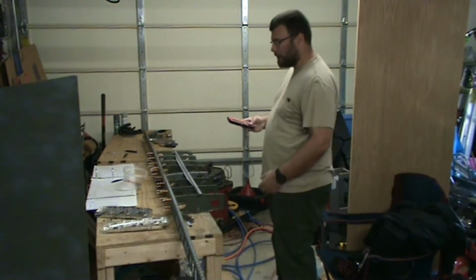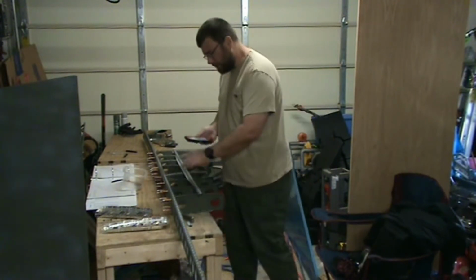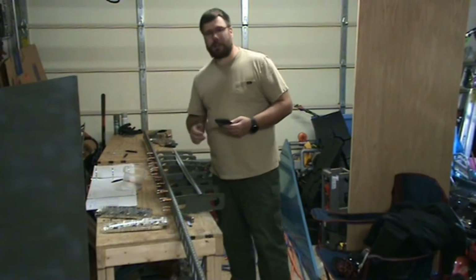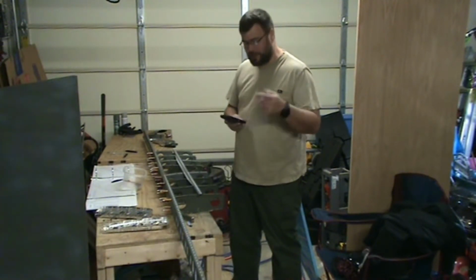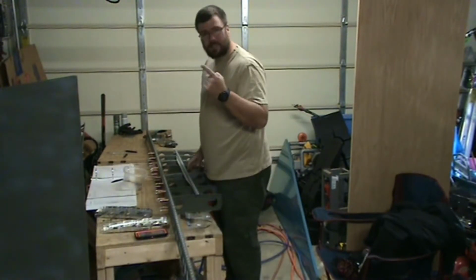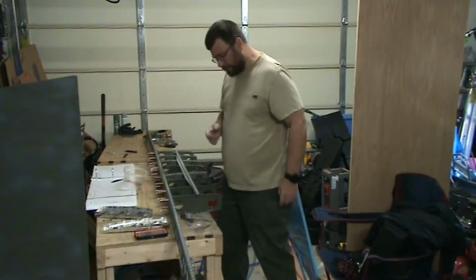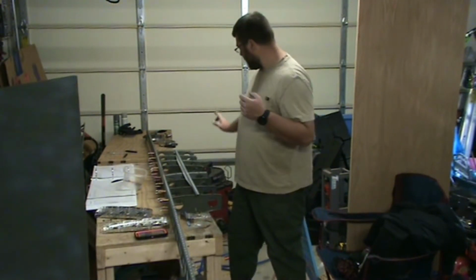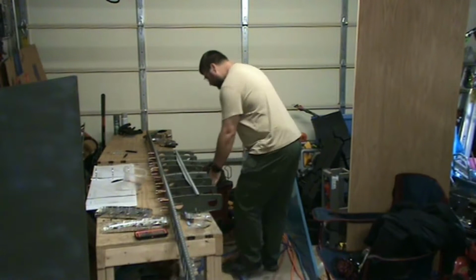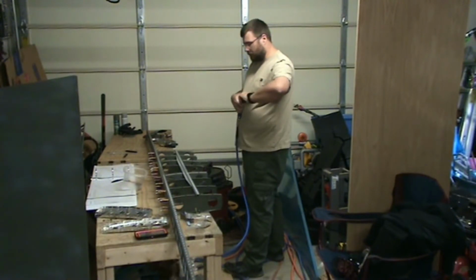So while I'm waiting for that to heat up the space, which it can definitely handle, it's the bigger Mr. Buddy, I'm going to rivet carefully into place the six ribs that I have available. And I say carefully because there's two different rivet sizes being used, so I'm going to make sure to get those correct. And on this, I really want the factory head to be on the inside here and the shop head to be on the outside here. So I think it's back to the double offset, and I'm going to have to make sure to crank the air compressor back up just a little bit, because it doesn't quite drive the rivets as fast as I would like.